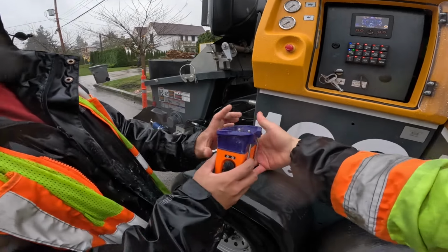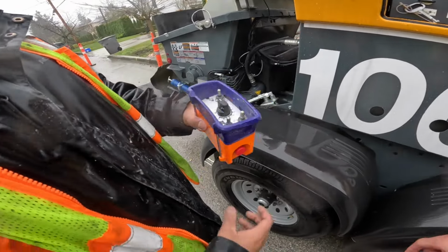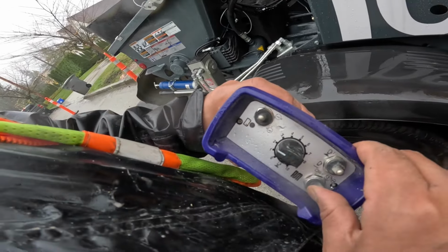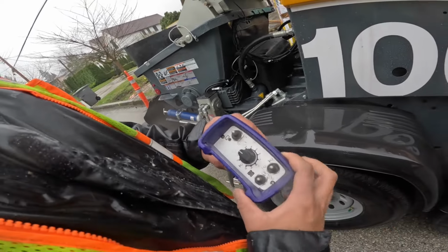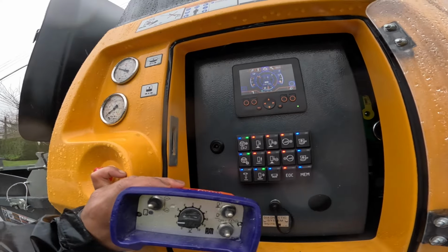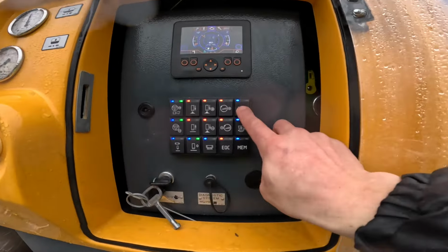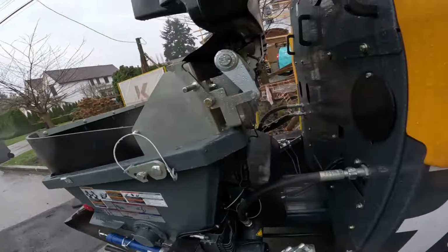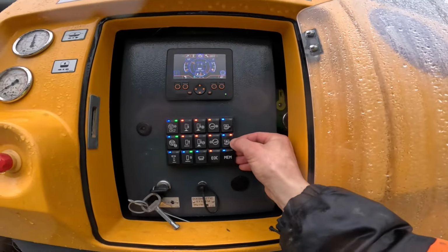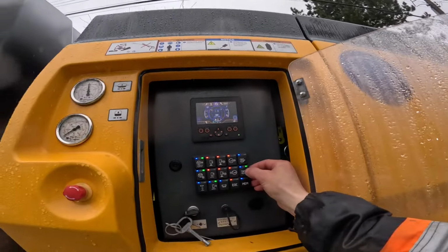Okay. Start with power on, right? And e-stop out. And then this little button here, push it once short, and then hold it on the second one. The little green light flashes. Now we're connected. It is that super duper easy. There you go. And once more, light goes green, link it up. So agitator forward with this one, just like that. Agitator reverse is that one, just like that. Pretty darn simple.